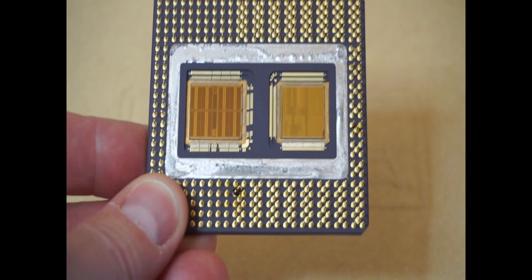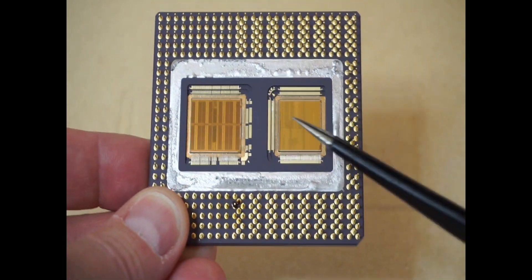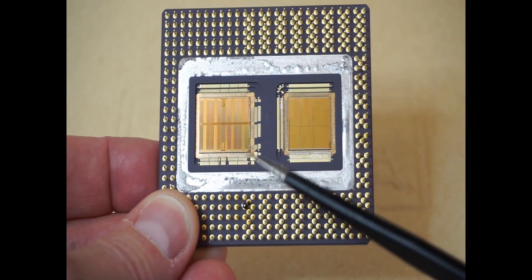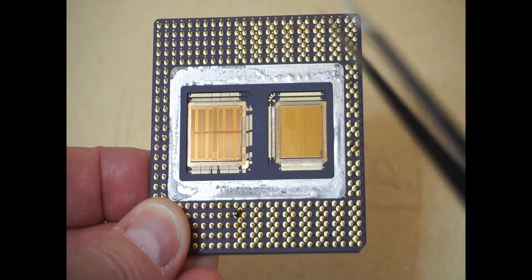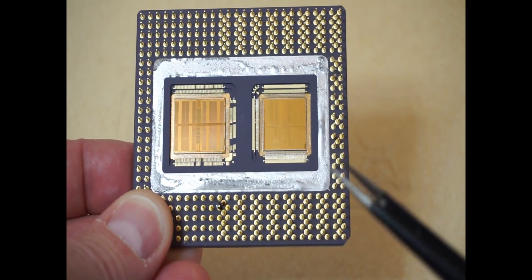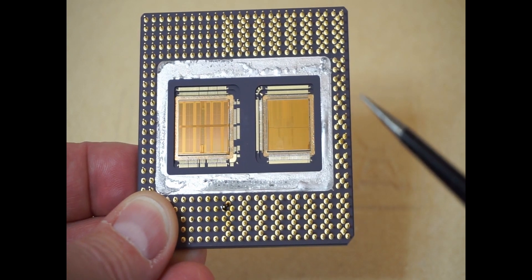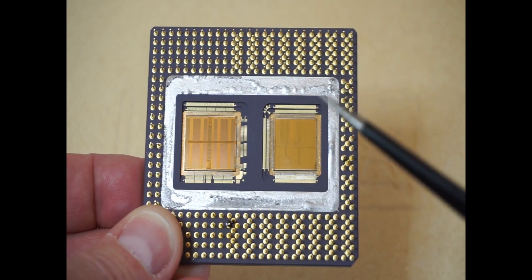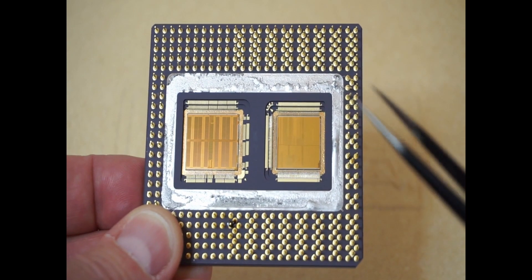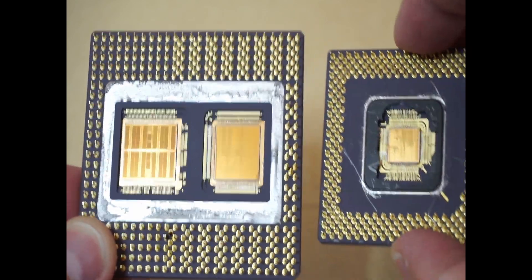Of course, a very nice dual die. On the right side is the CPU — quite a large one. On the left side is the second-level cache. The Pentium Pro was produced in different versions varying from 256 kilobytes to 512 kilobytes and even one megabyte of second-level cache. The one-megabyte version looks quite different as it is a black CPU. Unfortunately I do not have the black Pentium Pro in my collection.